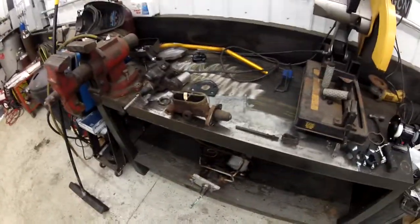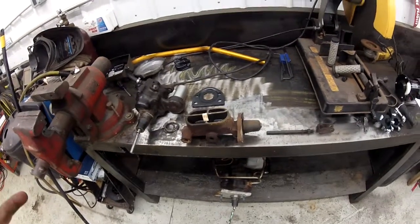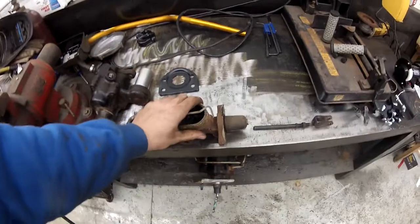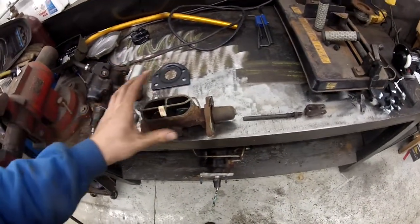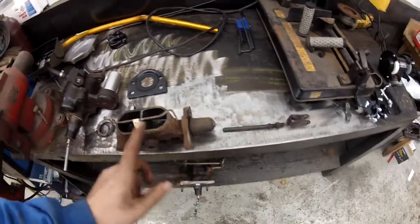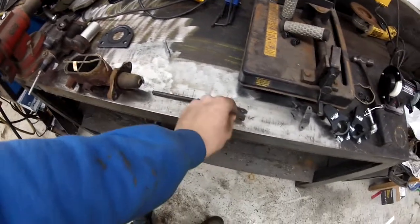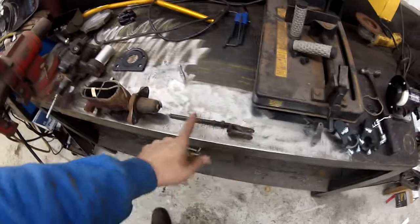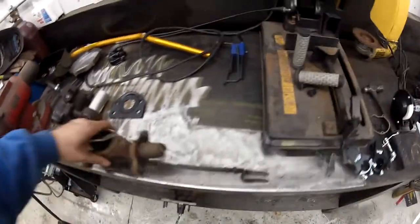This video is going to show what I did with the brake setup for this 69 Chevelle wagon I'm working on. This is the stock master cylinder — it obviously had manual brakes on it. I'm going to power brakes with a hydro boost setup. The factory setup had a rod with a clevis on the end that hooked to the brake pedal, but that's going away because it's manual.